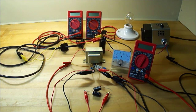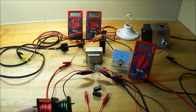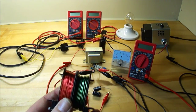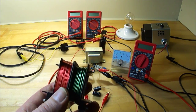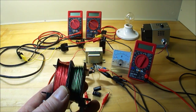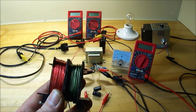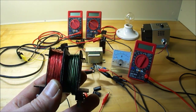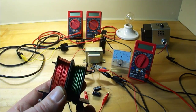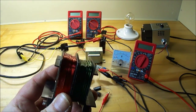What I figured out yesterday has to do with coils and the resistance. Here's a transformer core — it's from one like that bigger transformer in the back. When we wind one of these coils, there's a certain amount of resistance wound in because of the wire. Now these ones are all single wire coils. When you use this in an AC transformer, you have impedance that kicks in, which is like resistance. There's been a lot of talk about superconductors and a lot of costly ways of going about reducing the resistance to be able to improve efficiency.